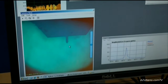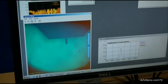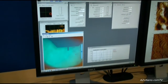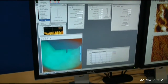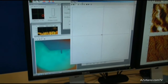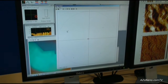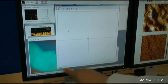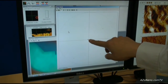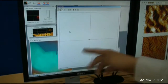We also have an option to optically move the tip. For example, if there's a feature in the image I'd like to go to, I can simply click on it and the XY stage will move it underneath the tip. Another way to move the XY stage is through a stage control interface. Here I've marked four positions along the stage where our sample is mounted. You can input these coordinates yourself, and for scripting, after executing a script, it will move to these positions in an order you specify.